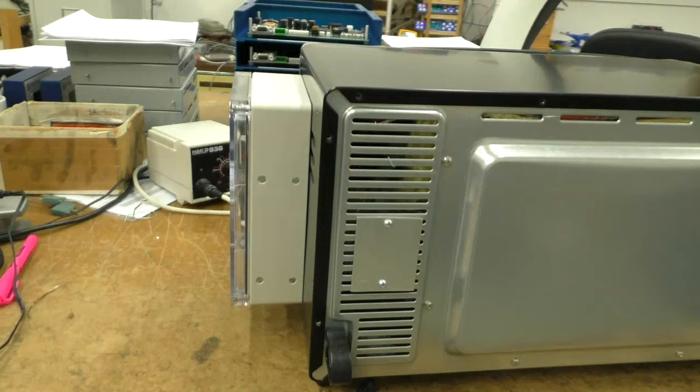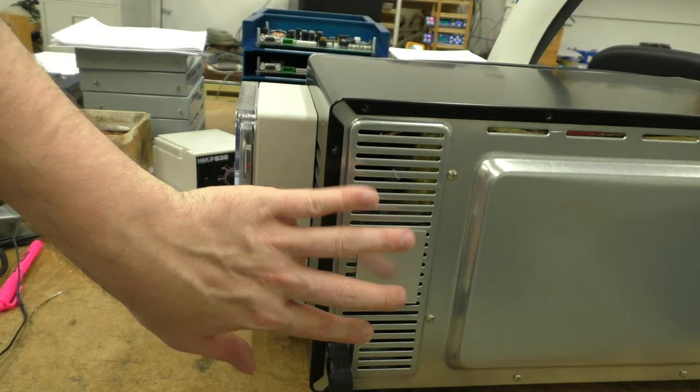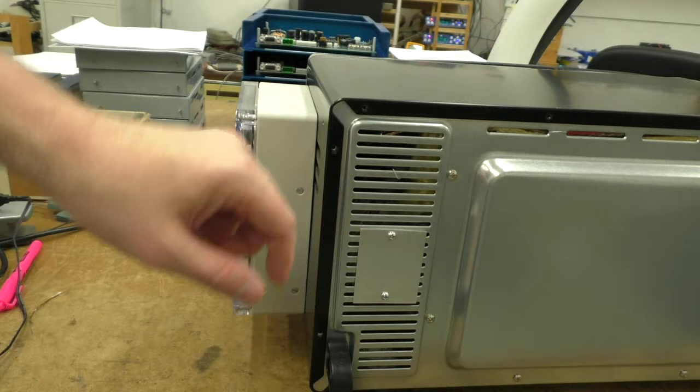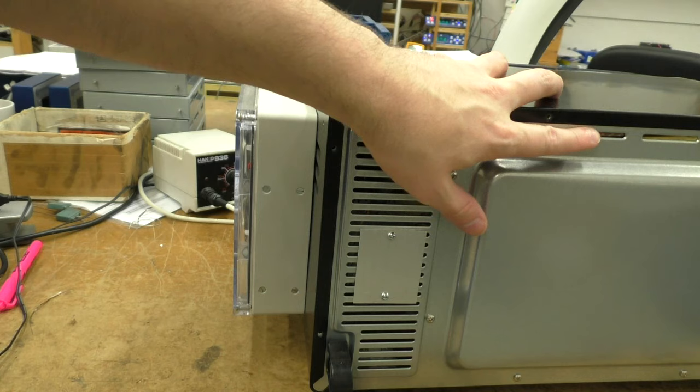In the back, there's really not a lot to see. The solid state relay is behind this aluminum plate, and this is just a backer because this sheet metal is really thin, so that solid state relay is just screwed into this aluminum plate on standoffs on the other side. And you can see the insulation here, some of the insulation there, and there's the thermocouple wire. And I used Teflon coated wire to connect that fan over there, that way it's not going to melt. And then I just have some little wires here that hold it in place, and that's pretty much it.